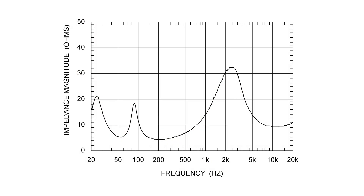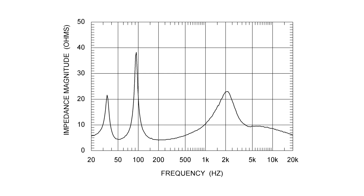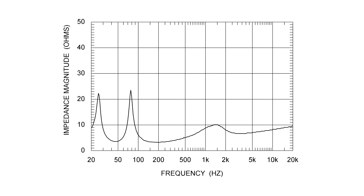And why do we use volts? Because loudspeakers are never simply 8 ohms or 4 ohms. They might be at certain frequencies, but I'm going to put up some impedance charts we created on real loudspeakers and you'll see they're all over the map — could be 30 ohms, 3 ohms, 8 ohms, 4 ohms, 7 ohms, 13 ohms, whatever. Across the audio band, the impedance is varying.